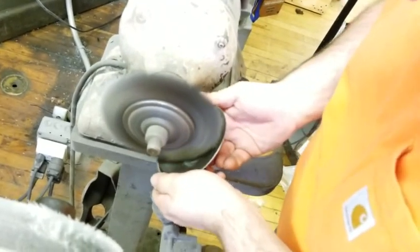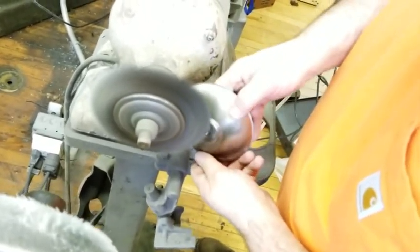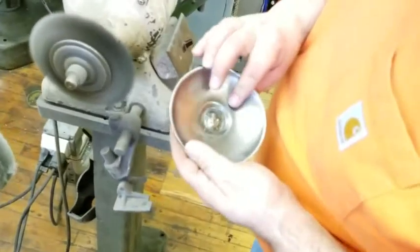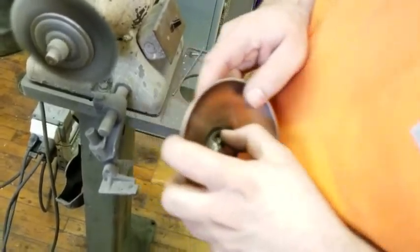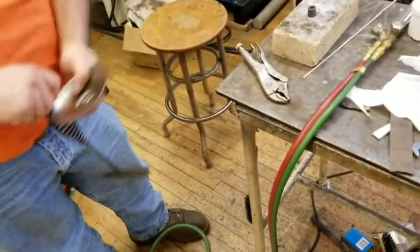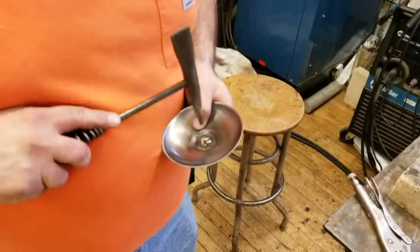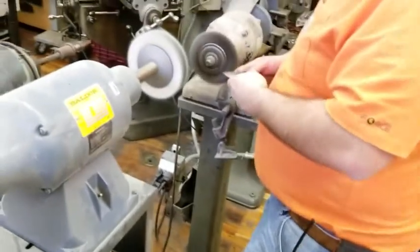You should do the screw thread, still the black. Yeah, I'm going to. That was just probably something on there that burned off. Inside good? Well, it's better than it was. We're getting that glassy stuff, that's the remains of the flux. See, the white stuff on the rod is the flux. That's going to come off and we'll get rid of all this discoloration. Then we buff it out.